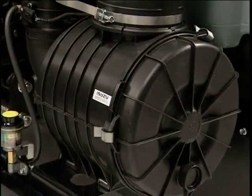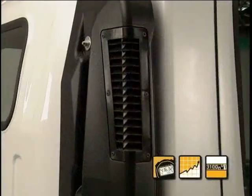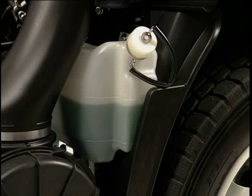The big Donaldson air filter is on the passenger side of the cab, well-protected, taking in cool fresh air up high. Diesel models have a filter minder air filter restriction gauge that lets you know when it's time to clean the filter, translating to lower maintenance costs. The engine coolant reservoir is mounted just ahead of the air filter, so it's an easy check during daily inspections.